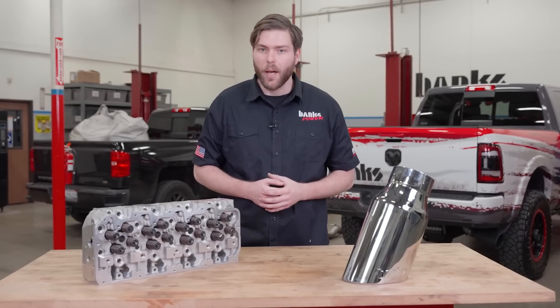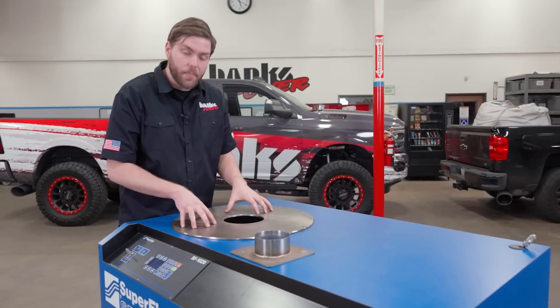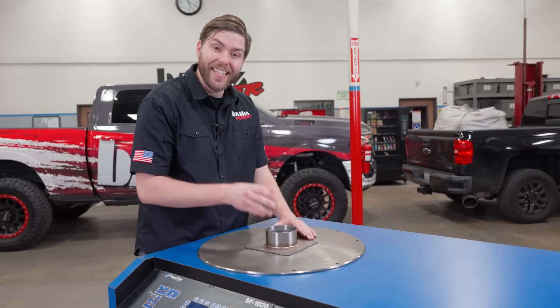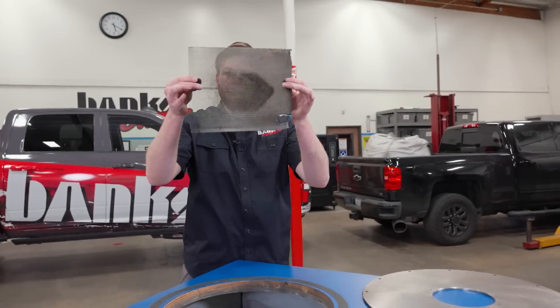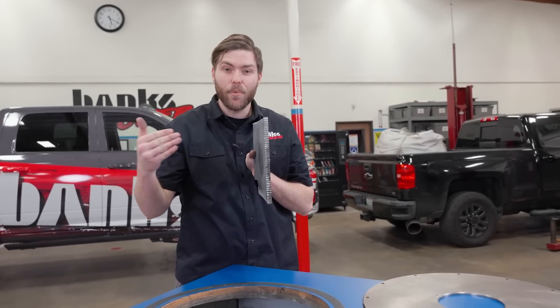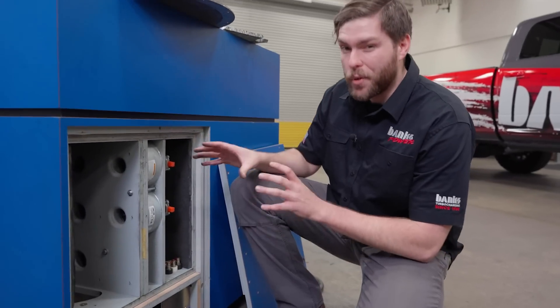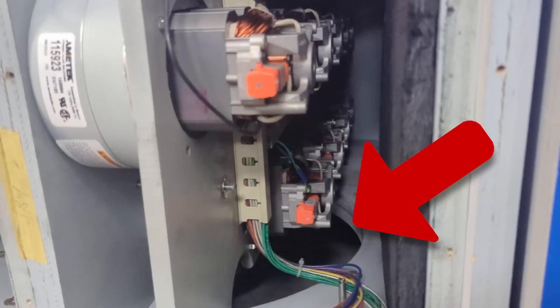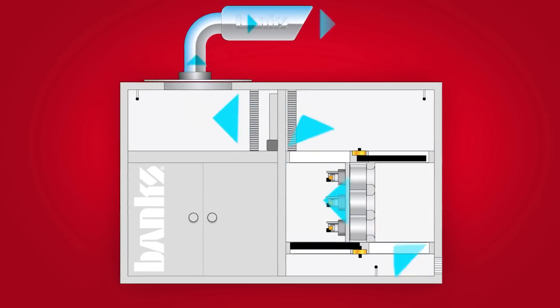Let's do a quick breakdown of what a flow bench is. Flow benches are used by race shops to measure airflow in cylinder heads, or by aftermarket manufacturers like us to measure airflow in components like exhausts or intakes. Starting up top, we have a precision ground adapter plate that allows us to use adapters to hook up to any component being tested. Inside the first chamber, you'll notice the flow straightening mesh, which promotes very laminar flow across the cross section for consistent readings. The bench has 14 vacuum motors. Above and beneath the pumps are cutouts, each with a rotating plate — by changing which one is open and closed, we can change the direction of airflow to intake or exhaust depending on what component is being tested.